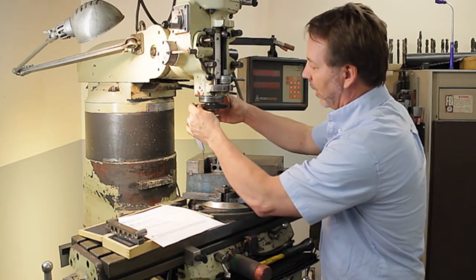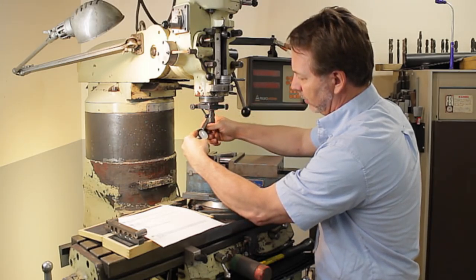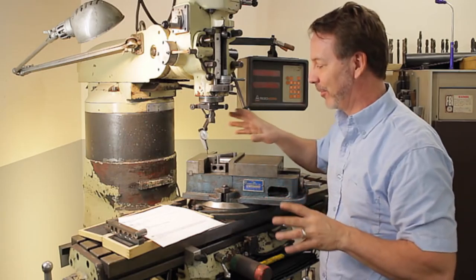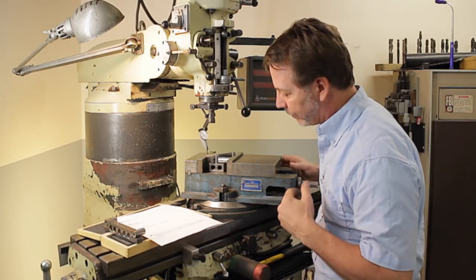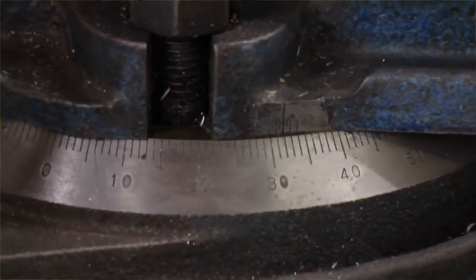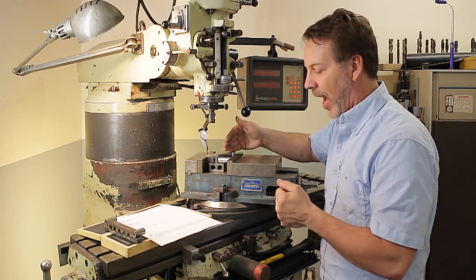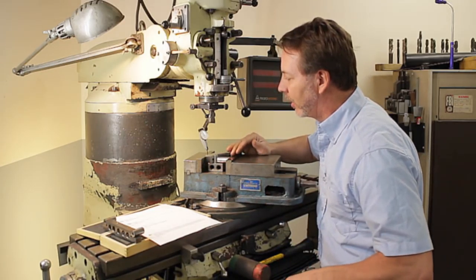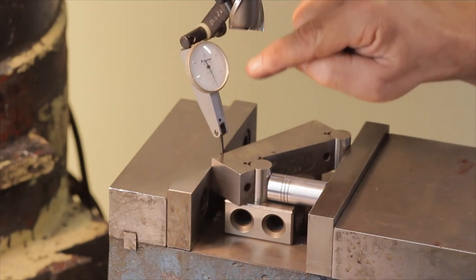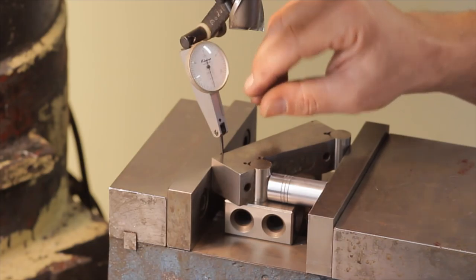You're also going to want to press this in against the vise, kind of square it up and go into it. Here's our indicating edge that we want to work with. We're going to do the exact same method we did before — line up our probe. I'm going to keep it vertical, though I can make it horizontal; it's whatever I need to make it read. I'm setting it up here so you guys can see it a little easier. I know I need to be around 32 degrees, so I'm going to set this just shy of 32 degrees — that way when I run across the indicator I know what side to tap on and it makes it a lot easier.